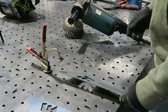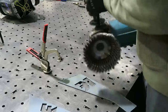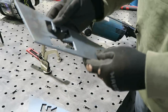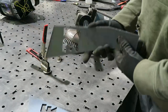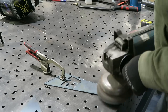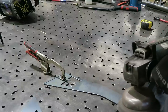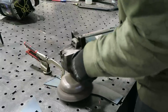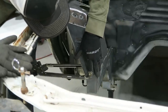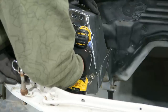Here's a little pro tip: if you do any plasma cutting, get one of these wire wheels. All that little extra dross that's on the cuts will just come right off with one of these — you don't have to grind it.